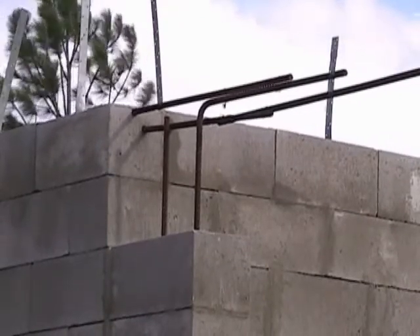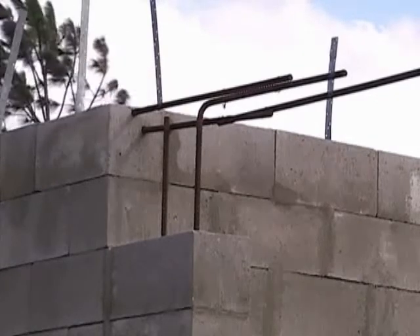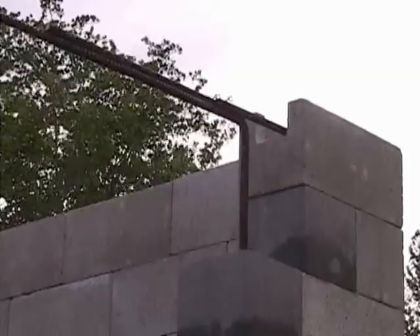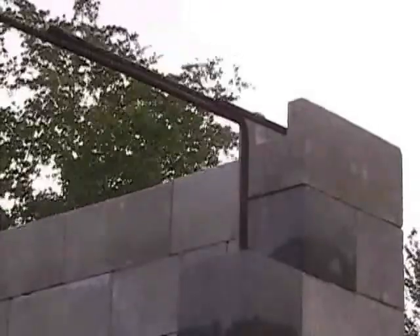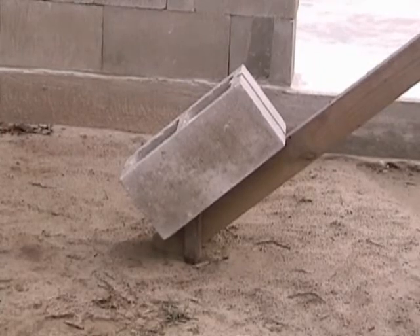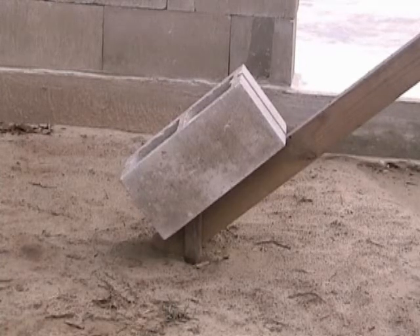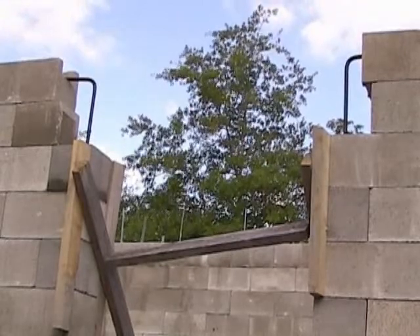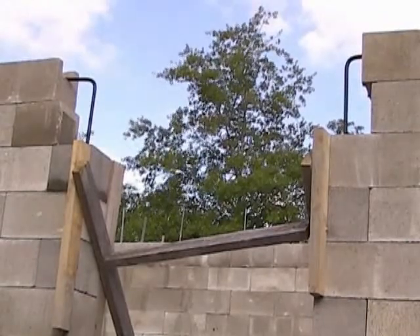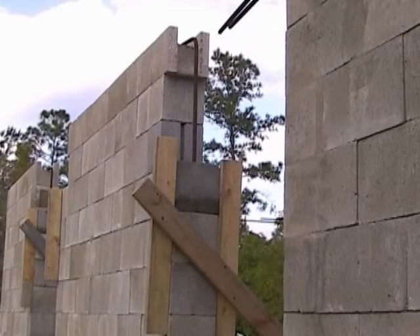It's a good thing I braced the walls last night because we had a storm come through here with 30 to 50 mile per hour gusts that lasted all night long. You can see the trees moving in the background — it's still real gusty the next morning. This video clip shows the header detail on the right hand side of the garage door. This temporary rebar is tied up to the vertical rebar to hold it in place and in alignment while I pour the concrete. The mass of the concrete block on the stake reduces and dampens out any vibrations that the wall may transmit down to the stake which is in sandy soil — this stabilizes the brace. The boards cut to length and hammered between the two braces keep them from slipping off the ends of the walls. The doorway brace fell out during the night due to the high wind gusts.